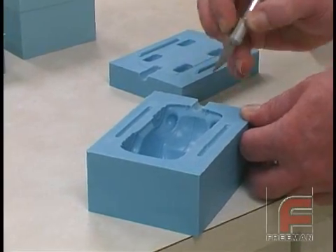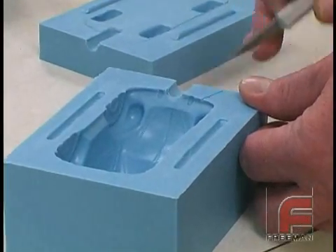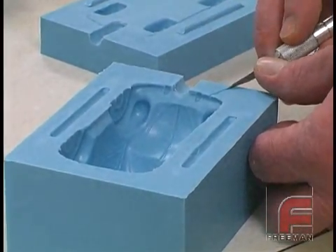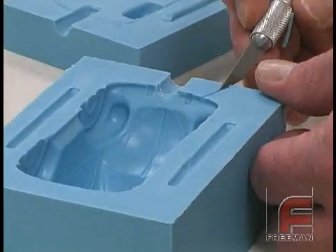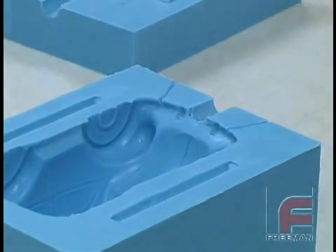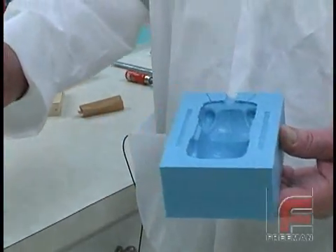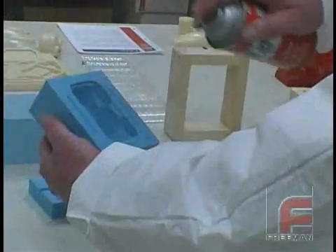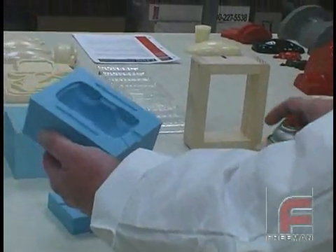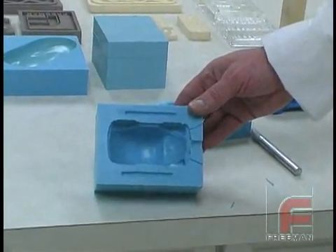In order to pour a closed mold, we need more than just an entrance for the material — we also need a vent for the air to escape. We could cast these vents, but since V340 is a harder rubber and cuts very easily, we've decided to cut the vents on one side of the cured rubber. All we need are small vents, just enough for the air to escape, but not too big to require a large repair on our finished part. Since silicone rubber is self-releasing, it doesn't need a release agent. However, in order to make the demolding process easier and to increase the life of our mold, we're going to apply a light coat of silicone spray parting agent. Notice how it gives the mold a higher shine as well.